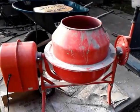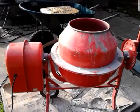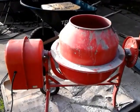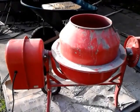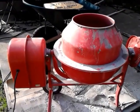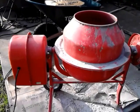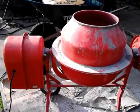To make this job easier, we're going to be using ready mix concrete and a Harbor Freight small concrete mixer. After coupon, it was about 110 bucks. Pretty inexpensive way not to lose your back. Now we're going to get ready to mix it. We use 1 gallon of water for every 80 pounds of concrete.